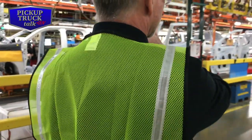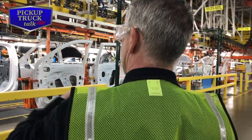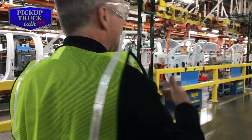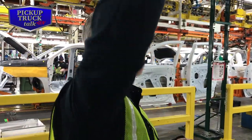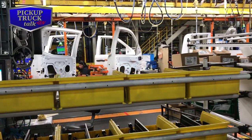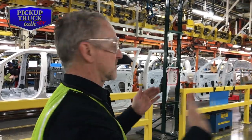What's new here is this is the doors off process. It comes from the body shop, they're all set, fit, just right. But then they'll take them off and they'll ship them to another part of the plant, and they'll build up the doors. The doors were on originally. Comes out. They paint it with the doors. Then you can see it moves over here. They trim out the door and converts itself back in line. But the barcodes keep them. Yes, the sequence keeps them together.